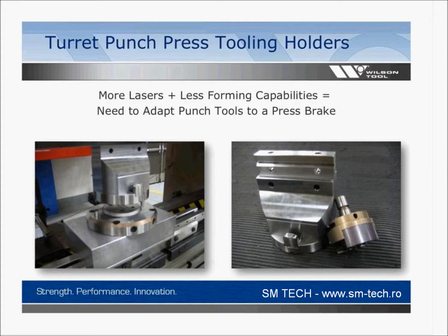And the final slide we have here is just showing you that we do make, and I think it's getting more and more common to see, some sort of holder that holds your punch tooling. So here again, you don't put it in the punch press for any other reason. Maybe you bought a laser and you just don't have a way to form, but you want to do it in the press brake. You can use some of your punch tooling with the correct holders to adapt that tooling into the press brake.